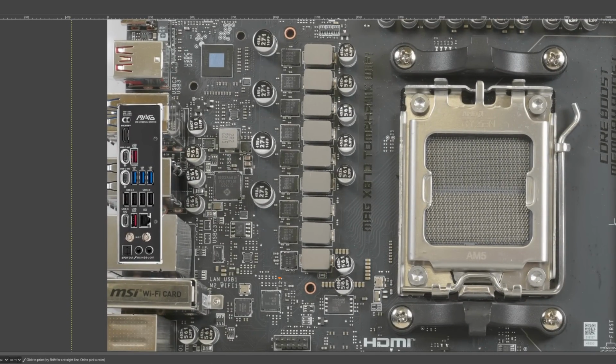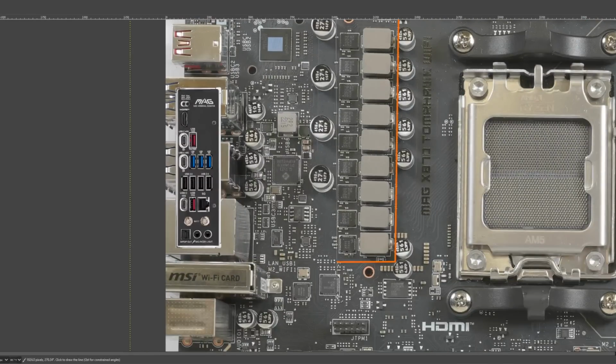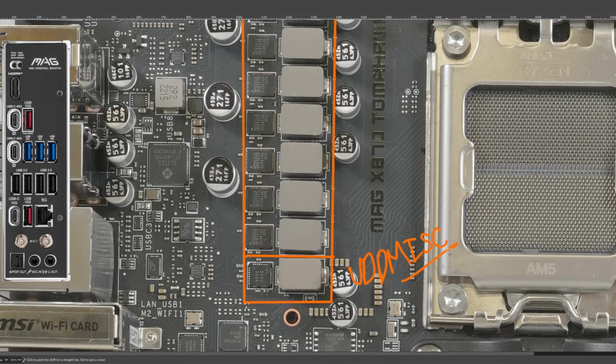Anyway, let's talk about things that I do understand why they exist, which is CPU power delivery. Because without that, your CPU wouldn't work. We've got a whole bunch of power rails, as is normal for AM5. So we have VDD MISC down here. This is primarily power supply for the Infinity Fabric links, as well as other stuff, which is why it's MISC for miscellaneous. There's too much random stuff that's powered off of this rail, so it doesn't have a specific name because it powers random things.